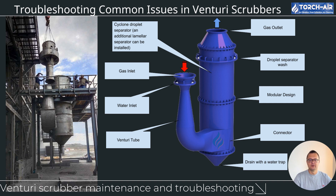Poor cleaning efficiency: if your scrubber isn't achieving the desired cleaning efficiency, it may be due to incorrect settings or mismanagement of the system's working point. Start by checking that the system is operating within its design limits for both CFM and dust load. Also check that the scrubbing liquid flow rate is optimized for the pollutants being treated. To further improve cleaning efficiency, ensure the scrubber is operating at its intended working point, which depends on the type and concentration of pollutants.